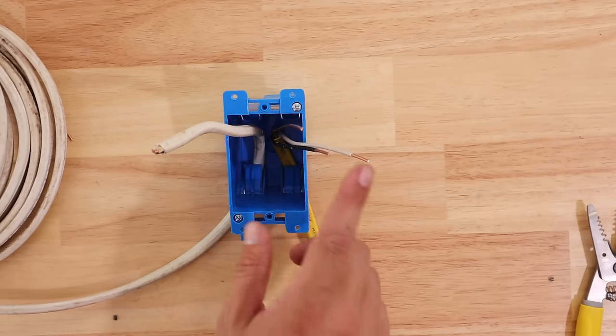If the circuit breaker is a 15 amp breaker, then you could get away with the 14 gauge wire because that 15 amp circuit breaker is going to trip before more amperage is sent through than the 14 gauge wire can handle. But the problem is if in the future, someone who doesn't do their due diligence maybe owns your house and does renovations — they see just one of the types of wires in the box and assume that's what's running on the entire circuit, which could lead to a lot of confusion and hazards down the road.